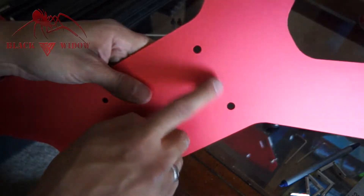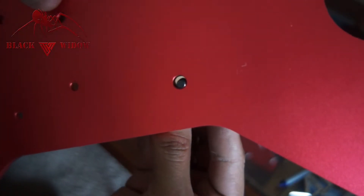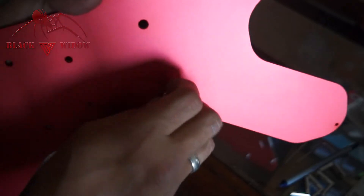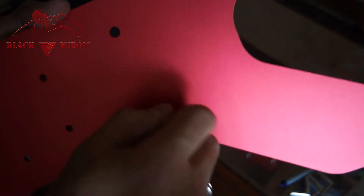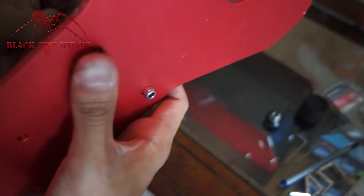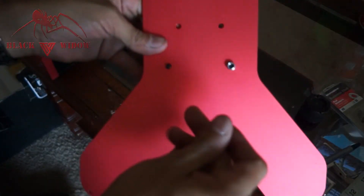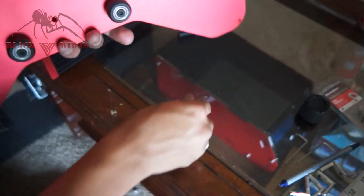The eccentric nuts go on the side that has the bigger holes on the bottom of the bed frame. The little round part of the eccentric nut fits perfectly into that space. I put them on backwards at first — the weird rounded oval part actually faces upward. Also grab two more nylon lock washers from your parts bin. The bolts may not be quite long enough to hit the nylon lock, so we'll put them on for now and flip them when a fitting wrench is available.